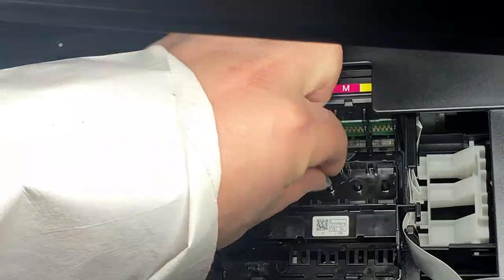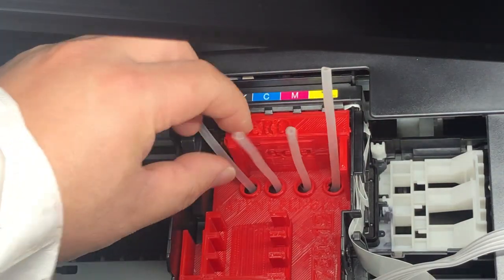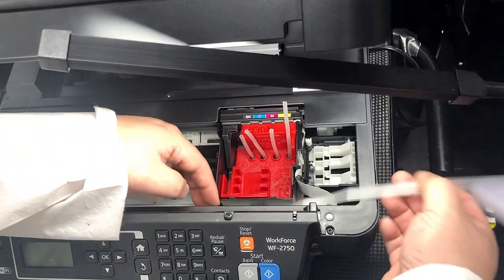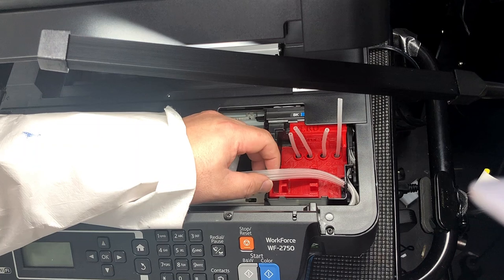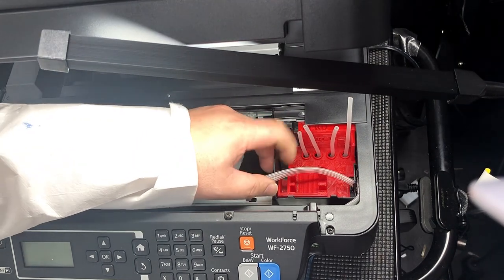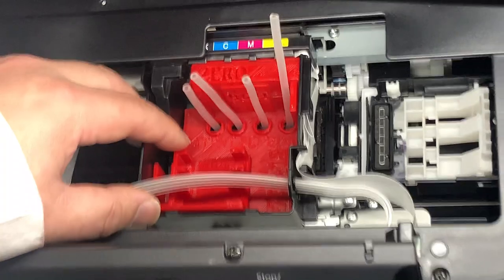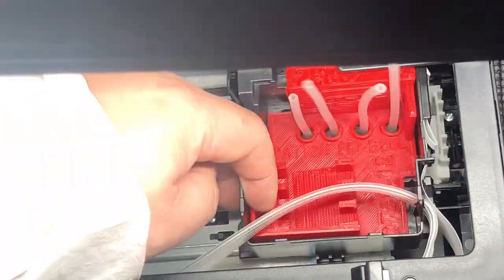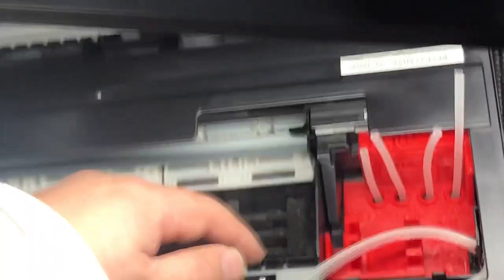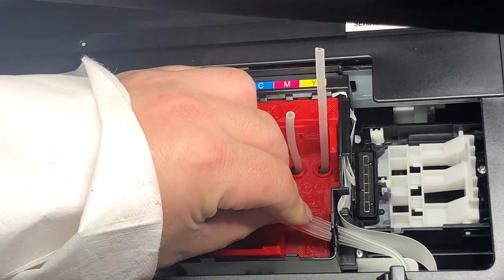On the right side, from left to right, we're going to put six centimeters, seven centimeters, eight, and nine. Now put the plate in and make sure the tube doesn't get caught underneath — make sure they come out right. With the black side down, put the tube in. Push it to the right side so we can gauge how long the tube is. Do not have too much tube — the problem with too much tube is it will sag, and when it sags it gets caught when the carriage is moving. So the tube should not be too long, and make sure the tube will be level.